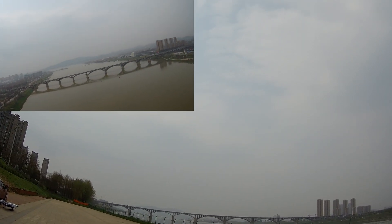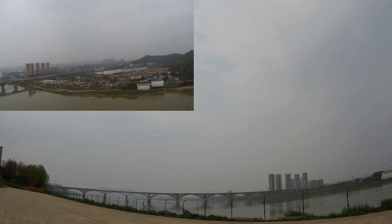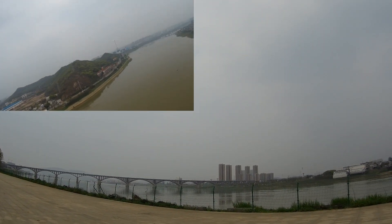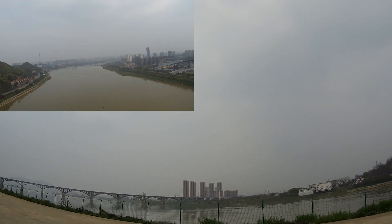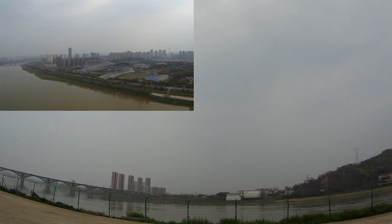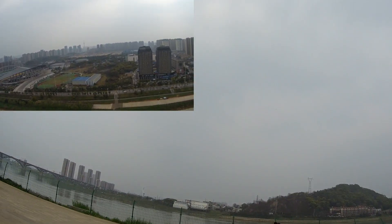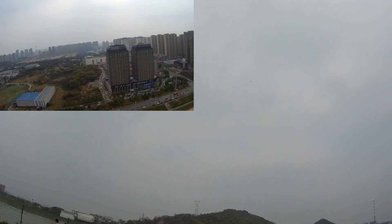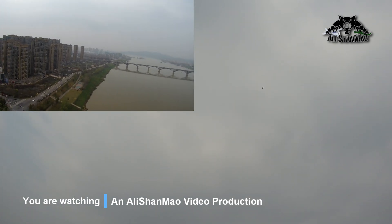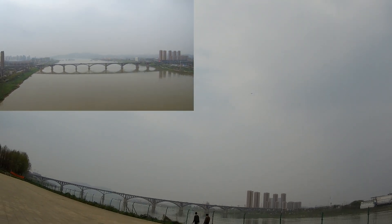I'm going to put it into circle again — that's a very big circle. I can still see it. It's doing its big circle. I should probably activate it right here over my head, but I'm worried about the buildings so I need to be higher. So I'm going to put it back to stabilized mode and test the auto return to home feature. Throttle to zero — it will climb to 160 meters when I do auto return to home.